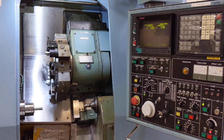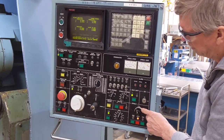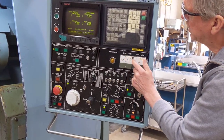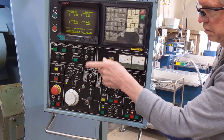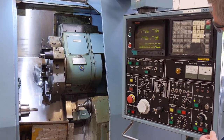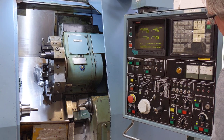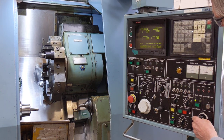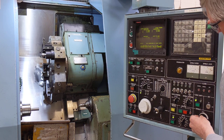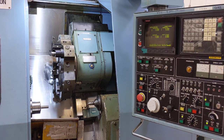The next thing I want to do is just turn the spindle on. You'll see the speed adjustment here — forward, reverse — and the spindle speed and the spindle load. We'll look at both the movement. We'll start this up. This is at just below 2,000 RPM; it goes up to about 4,000. This is forward — there, about 4,000 RPM.